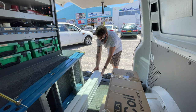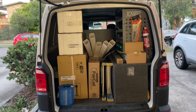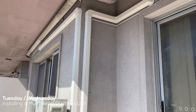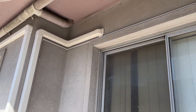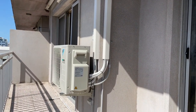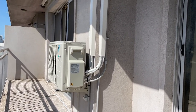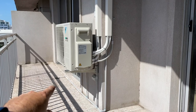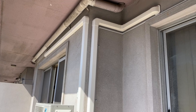Let's get started. This is called a Multi — got a unit in the lounge room and a unit in the bedroom. This is the Daikin Multi Light, so it's just a 7kW outdoor and I've put two 3.5kW indoors. The drain's teed in, and the condenser and the two drains all go to the floor waste — that's what I've done in the last couple of days.